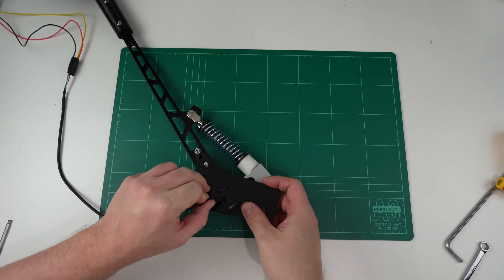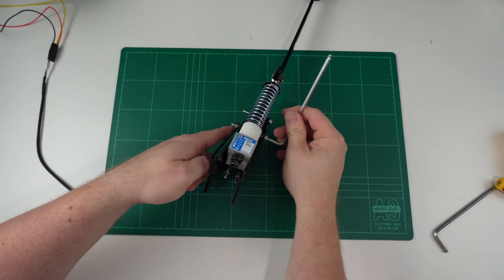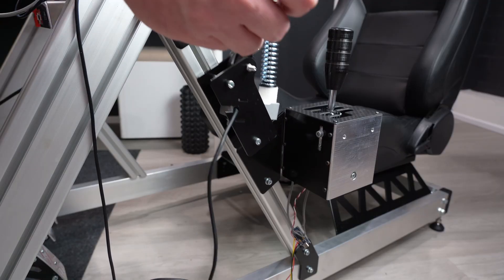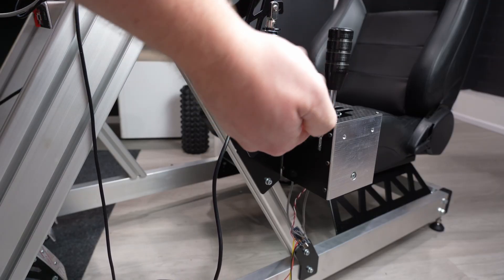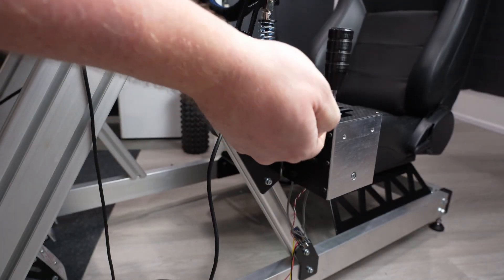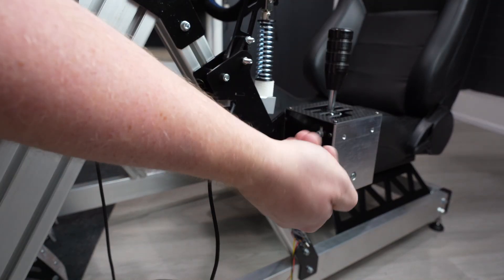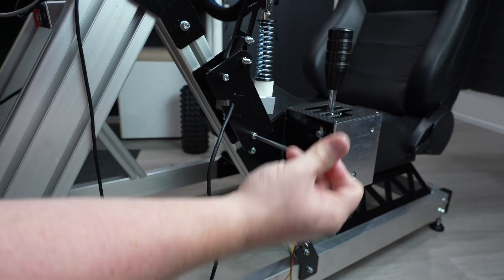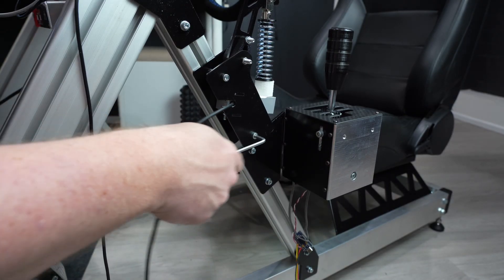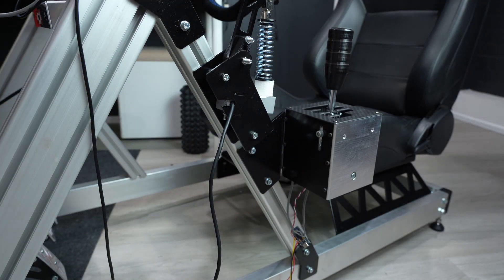Next, we can put the main bolt through the pivot point. I've installed a washer on the outside of the bearings and a printed spacer between the bearings so we can do up the bolt tightly without damaging anything. This bolt holds everything together, leaving the final two holes which we bolt through to attach the base to the sim rig. I've printed some spacers for these holes so the bolts don't pull the plates together when tightened, and then the same combination of bolt, spring and 3D printed dampener can be installed just like we did for the printed version. I've used M5 sliding nuts to attach it all to the extrusion. The software and electronics are exactly the same between the two versions, so all that's left to do is test it.